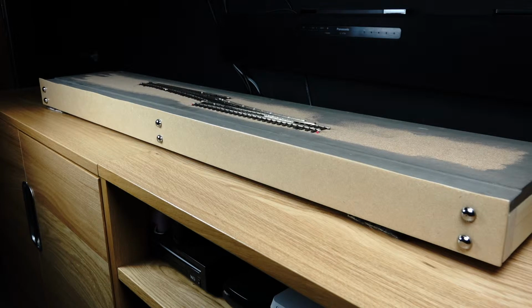Turning the module over, you can see that the only other addition that I made is to add an MDF fascia to the front of the baseboard. This has been glued and screwed using chrome head mirror screws just to make it look a little bit nicer. I've given this 2 or 3 coats of satin varnish, sanding between each, so it's got a really nice finish.